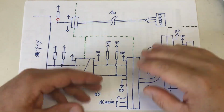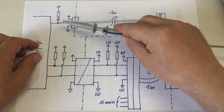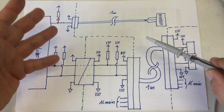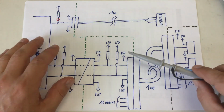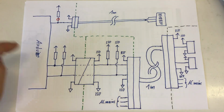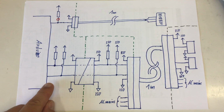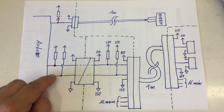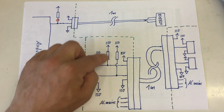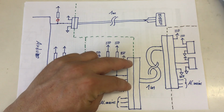While I was cutting the video, I noticed that it's not always perfectly clear where I connect my oscilloscope probes. So I created these little inserts afterwards to show you exactly that. To the left, behind that green line, is my controller with the Arduino, and the Arduino has two outgoing one-wire buses, each with a pull-up resistor, and they go through a digital isolator, and then they have two more pull-up resistors for the isolated side and go into a big connector.